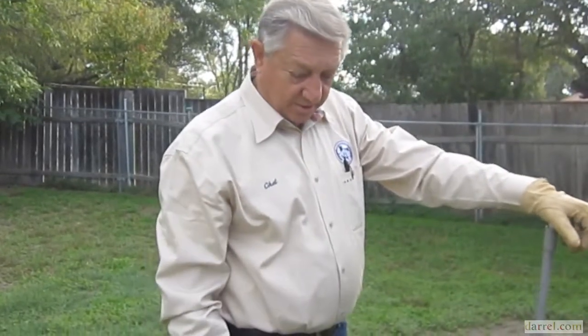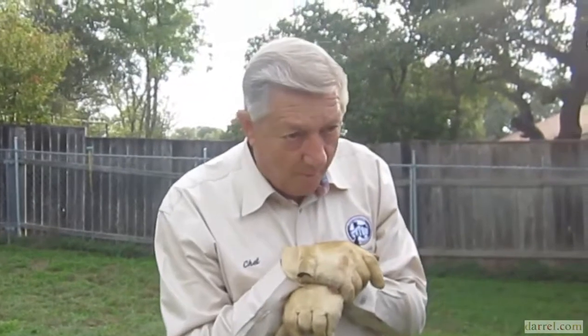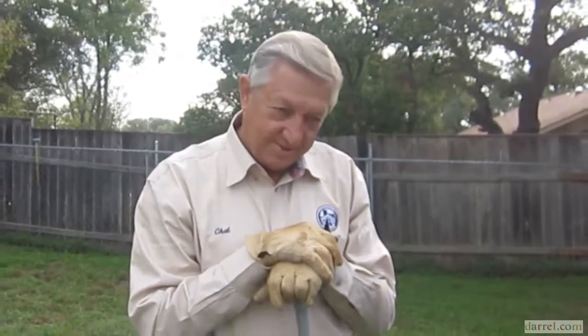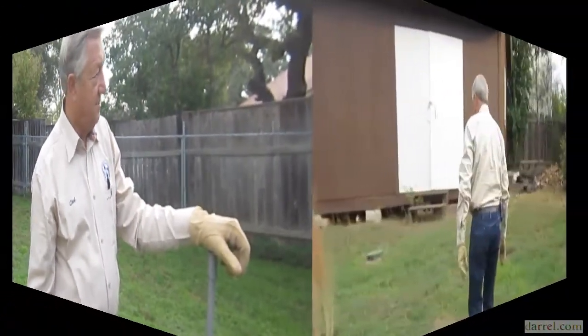So when the alarm goes off, now, is it ever going to go off? Yes. It's going to go off when this pump fails. Pumps usually last about 8 years. So it's not if it's going to, it's when it's going to. They're pretty reliable. It may last you 12 or 15, but normally, right here.